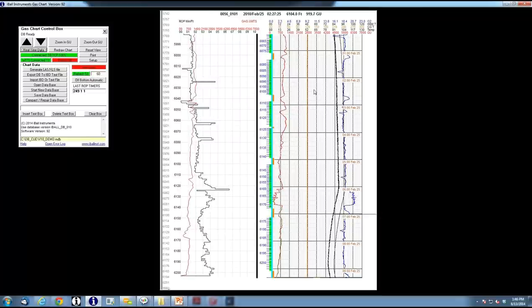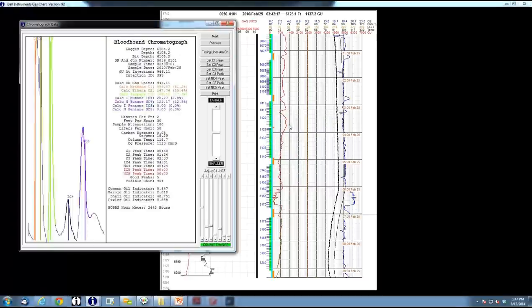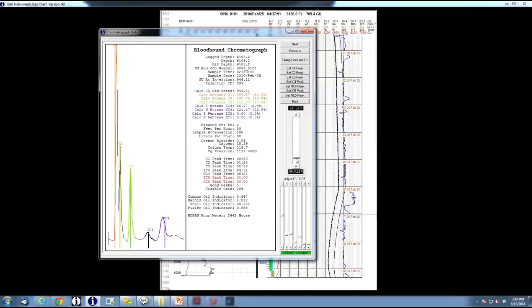You can double-click on the chart — I like to do it on the time side — and start dragging your mouse to draw a green selection box showing the amount of time selected. If you double-click again, a menu appears. The most important option by far is the chromatograph view. Here we're looking at the chromatograph view. Sometimes when you open them the chart appears off-screen — you can click and drag it up or down to reposition. The demo database was not set up with pentane, so no pentanes are shown. In a later chart with pentanes, there would be two more humps with two more marks.